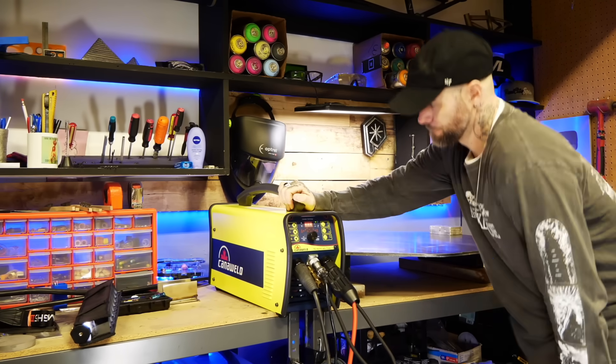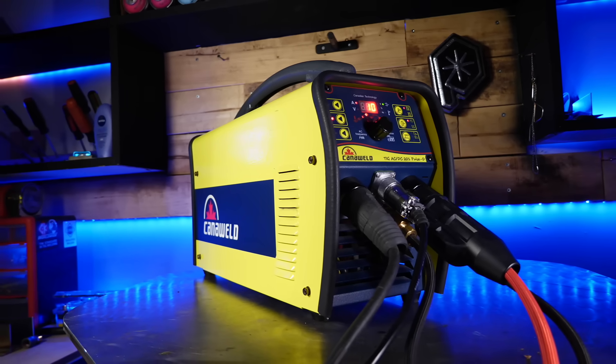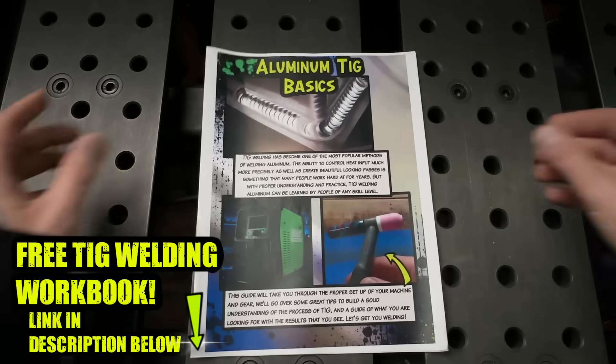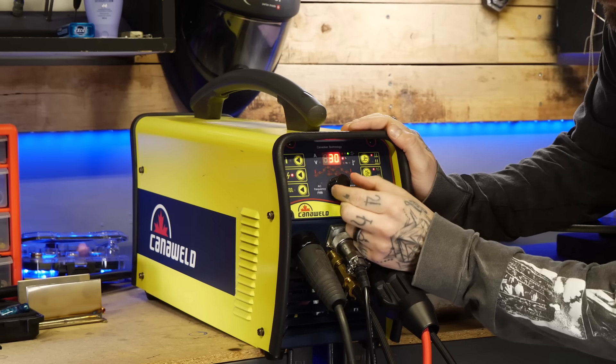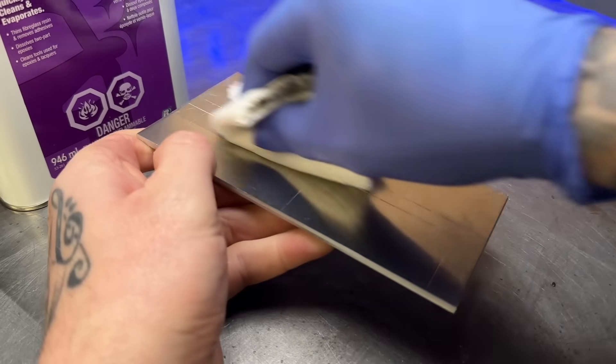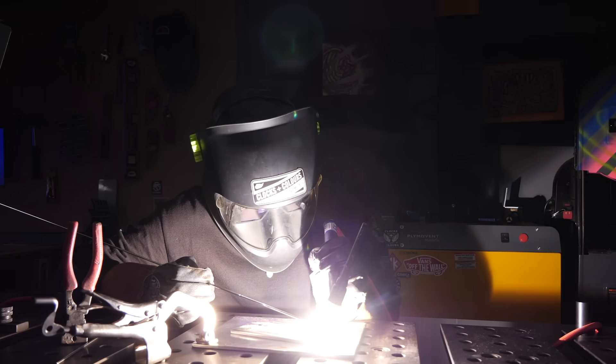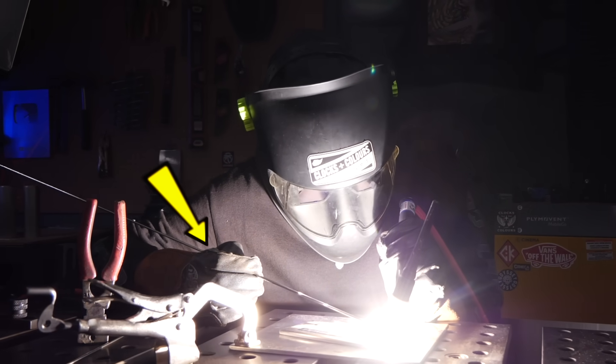Let me fire up the machine. I'm using the Canaweld 201 Pulse D machine — an incredible welding machine, great for beginners as well as serious work. I also have this free workbook I use to follow along with every episode; it's in the description below, go download it. I'm going to set up with super basic settings, clean my plate, and scribe a little line to follow. Getting comfortable and looking at posture — my torch hand can travel smoothly and comfortably, and my feeding hand is positioned well out of the way of my vision, ready to feed stationary from this spot.